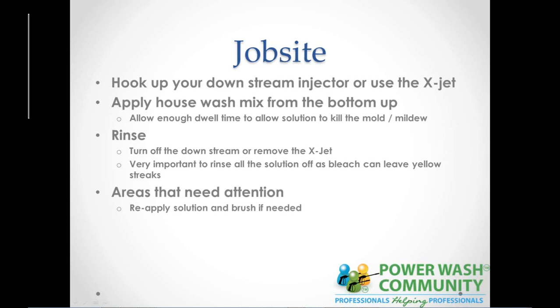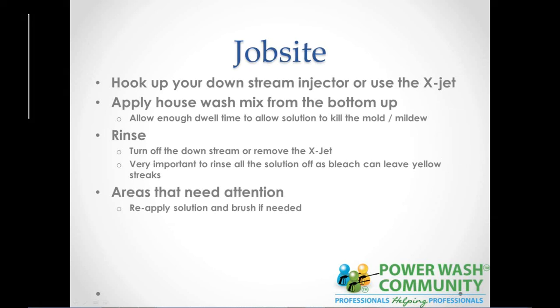And then to avoid streaks, Patrick Feehan said that he brings a bottle of Windex to address the streaks afterwards. I've never heard of that before. And then Judd West made a really good point. This even happens to me with fleet washing. If you've got a surface that's being hit by direct sunlight, it gets really hot, and the mist that hits it or a quick spray on it will flash dry it. It'll be real hard to get that soap off there later. So you may want to go through and wet down the surfaces before you start cleaning.